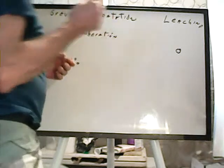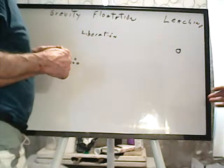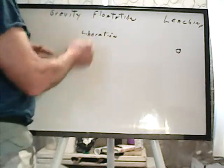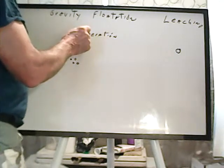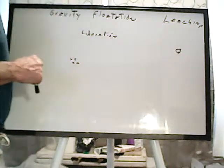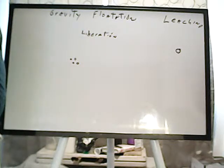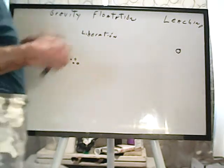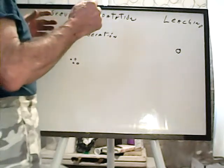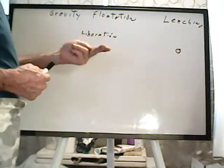Well, the nice thing about that is a combination of gravity, then usually the material goes to leaching. In a case like that where you have coarse gold, you're generally going to grind it to where it'll liberate the coarse gold, do a gravity separation, then leach your tailings from the gravity separation. Correct. And the positive thing about leaching is that you don't have to grind it quite as fine, everything else being equal. The negative to fine grinding is time, money.